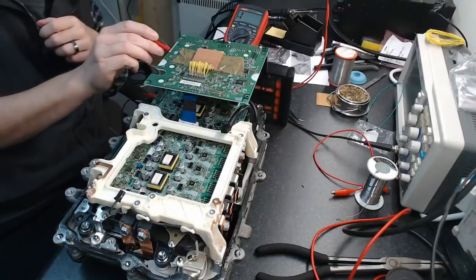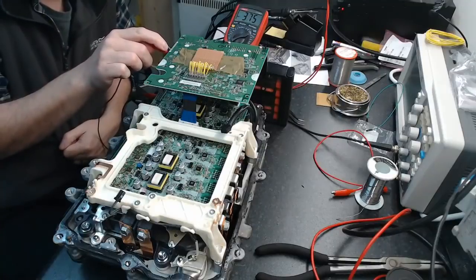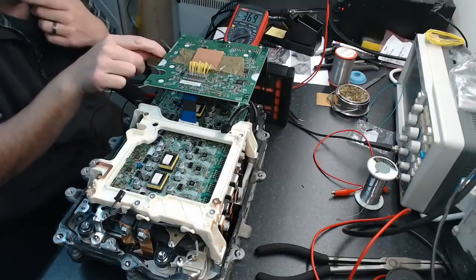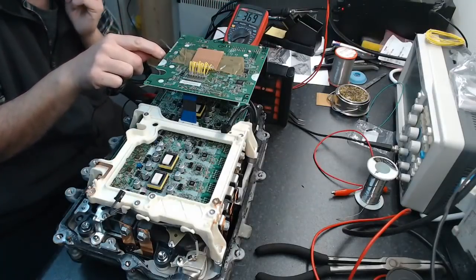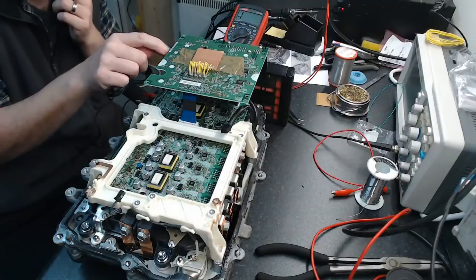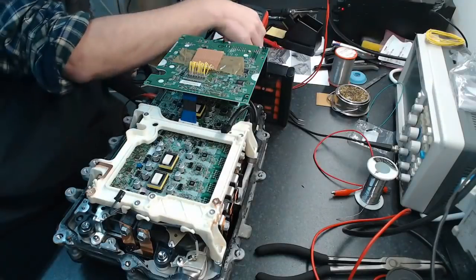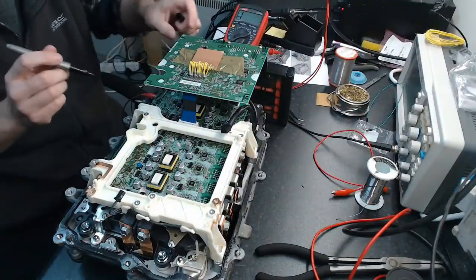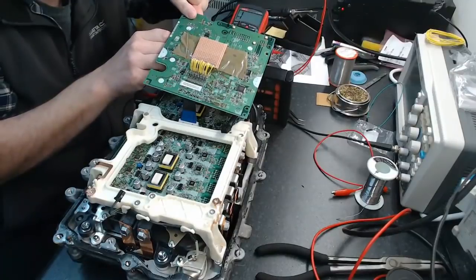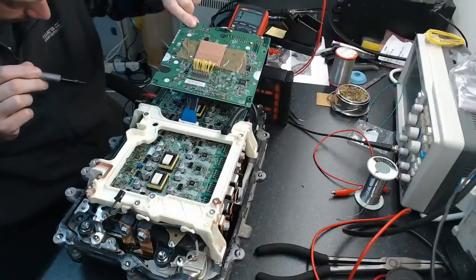And so what I can tell you is that just in here I can identify the DC bus positive by virtue of the fact that I'm seeing about 370 millivolts here, which is a typical drop across a Schottky diode, and I see nothing when I touch on the negative. So that guy down there is a positive, and that one's a negative. So get myself a bit of a marker going on here. I'll just mark that guy as the negative. It's got a black marker, so I'm just going to mark the thing as being negative.